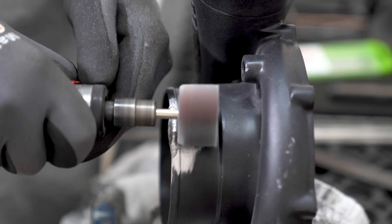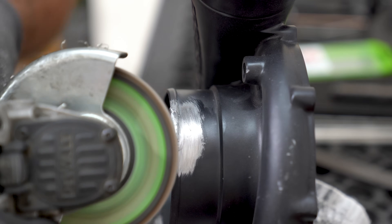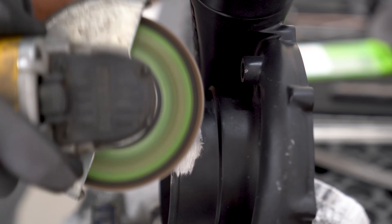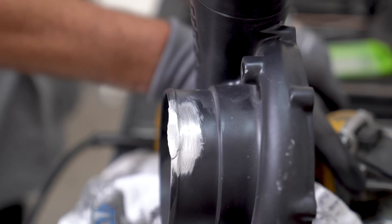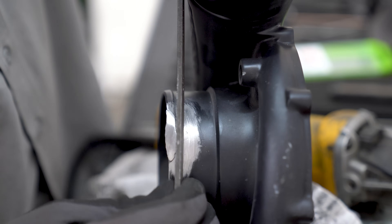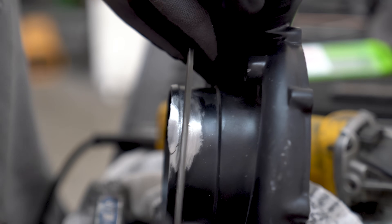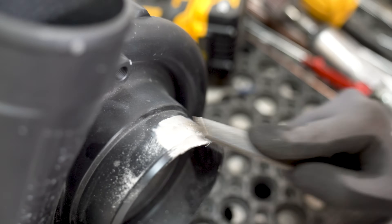You're going to need a lot of experience and you're going to need to understand that finesse and feel, especially if you're going to attack it like I do by using my big grinder. The flap disc on my grinder is a very comfortable tool for me — it takes down a lot of metal in a short amount of time, which gives me a general shape to work with. Notice that I don't take it all the way down though, just enough for that general shape. Next I switched over to my file. I need the file to finally define that contour as well as the lip of this inlet. Once the general shape was made on all the surfaces, I went back over with the flap disc to very carefully blend and shape it.